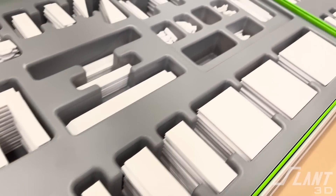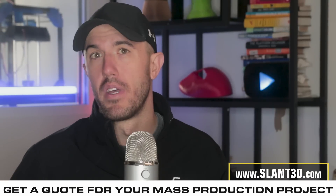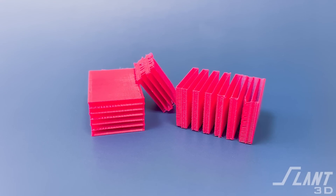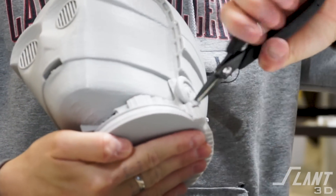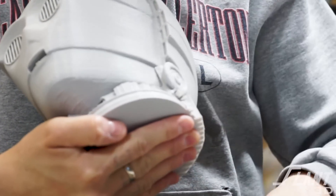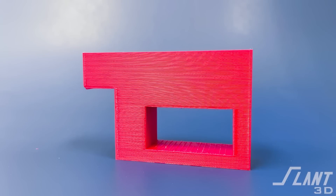If you're exploring the option to have a product 3D printed, there are a number of things you just don't want to do. If you're going to produce hundreds of thousands or millions of a piece, you don't want potential errors or problems. One of those main issues is the need for support. These are really undesirable because at the very least they increase post-processing, having to go through a tumbling process to knock them off. Or in the worst case, they can radically increase cost because they require a human to pull them off, since for any individual part it might not be automatable. So to maximize efficiency, you really want to minimize support as much as possible.